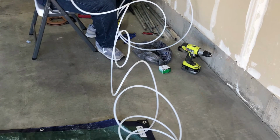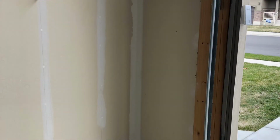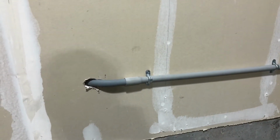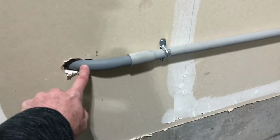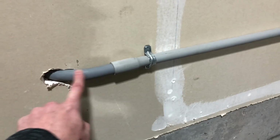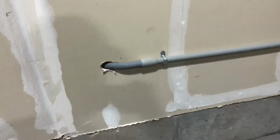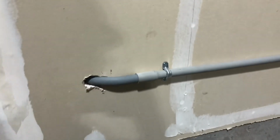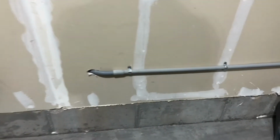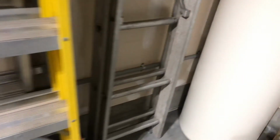After having hooked up the new tube to the water softener, ran it through the ceiling and into the garage, I next needed to, of course, locate the spot I wanted my new brine tank to be, which I decided to be right up front. Now again, I'm recording this video after the fact, just showing what I had done. I got some PVC from Lowe's, and this kind is used for sprinklers a lot of the times to run the electrical wire to your sprinkler box. But I have a curved piece that I have coming out of the wall. This is where the hole came out that I drilled from the other side. It's a little higher than I anticipated, but I've ran the tube through these PVC pipes, and I've used these brackets to hold it onto the wall. And so it runs up, which was near that electrical box, all the way over, and I've already put my ladders back in place. But you can see it comes all the way back behind here.